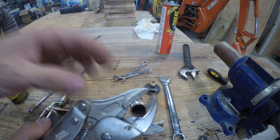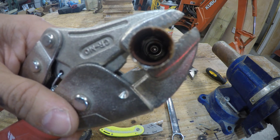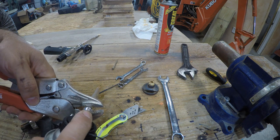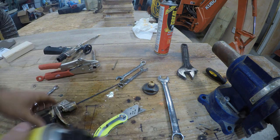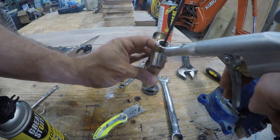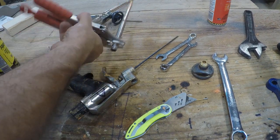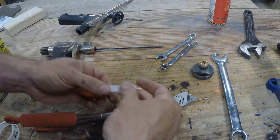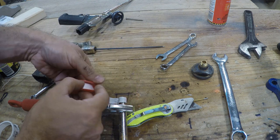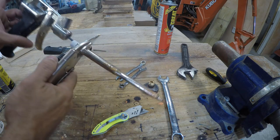Then I blow out the smaller chunks with the air gun, being careful not to blow away whatever small pieces you have laying around. Let's check the barrel — it already looks pretty clean. My previous one was packed as well and I had to drill that out too. A little more gun cleaner and we can put it all back together. I use thread tape — probably not necessary — and then thread the gun onto the barrel. Make sure it goes on tight. I was a bit too careful with the last one and needed to come back and tighten it more because there was a little bit of leakage.